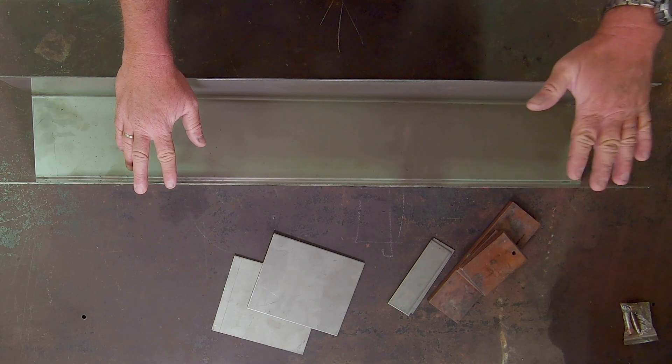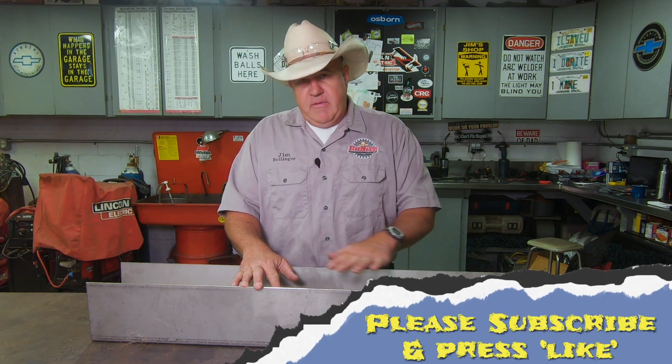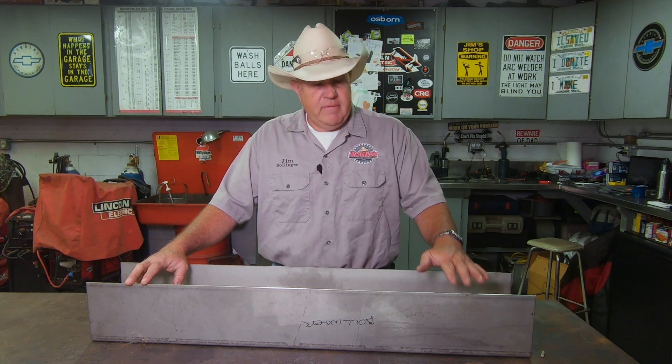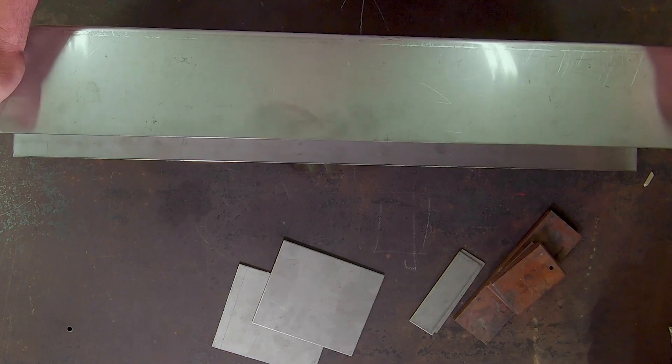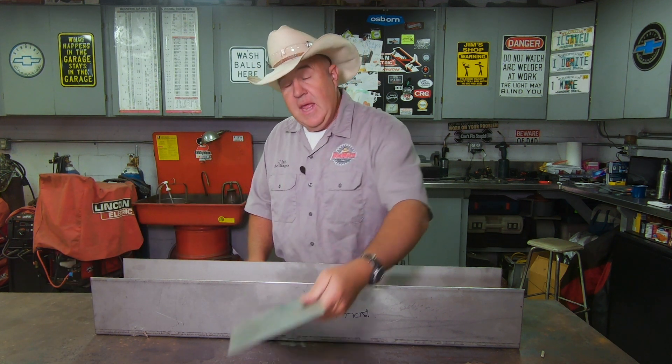This particular tank — I've built a couple of these already for a local gun shop. They use these in restorations of antique firearms when they have a gun that's been discovered with a lot of rust, but they don't want to destroy the original bluing. They have a process where they can boil the barrels, and this is built to their specifications. My buddy Brett over the Survival Comms YouTube channel saw this here in the shop and asked me to build him one. This is a piece of 1/8 inch 316 stainless, bent and sheared by the local metal shop. We're going to weld plates on each side to make a stand and an end for the tank.